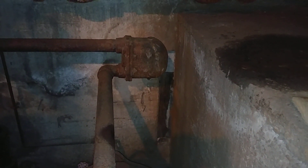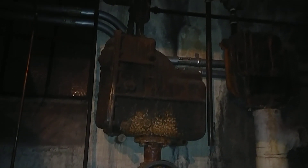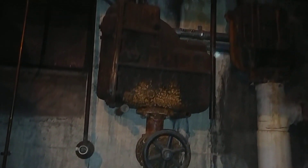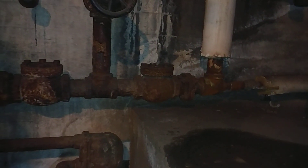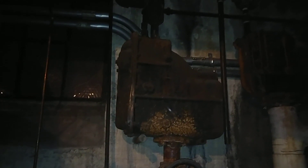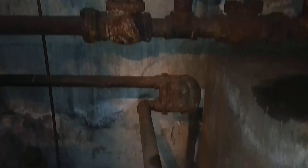It's got a master trap there, and probably one of the biggest return traps or return pumps I've seen in a while. That should be removed — it's not doing anything. In fact, it's slowing up the water return. You've got two check valves here, and that's how this thing used to work back in the day. But if we were to remove these two and just return this to gravity return, the system would work a whole heck of a lot better.